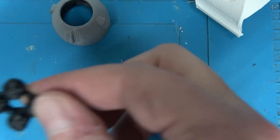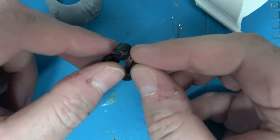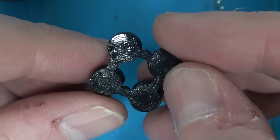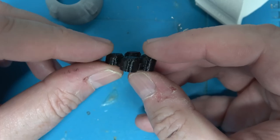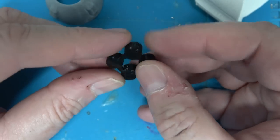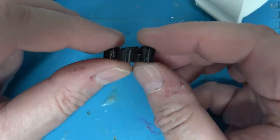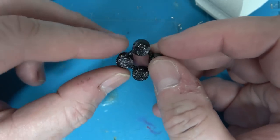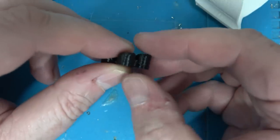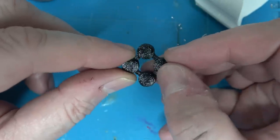Well, these are for the single-handed controllers that I make. Like, this is for when I move the four face buttons — A, B, X, Y — from the right and move them over to the left. And yeah, that's what it should look like — you can still see the lines, but there's no separation. So I'll actually print these on the MakerBot. The quality is not incredibly high — this I printed at 80 millimeters a second. This you have to print at 15, because it's a different type of plastic, kind of like nylon — you have to print it a lot slower. But since the MakerBot is old and slow, it's a perfect thing for it to do. So I usually just leave the TPU installed in it all the time.